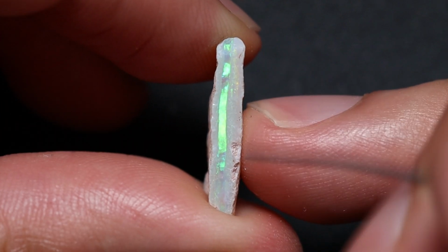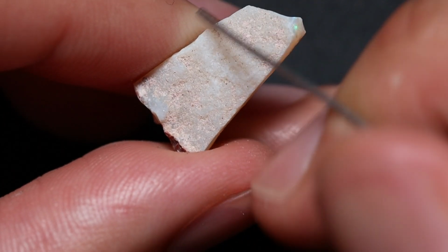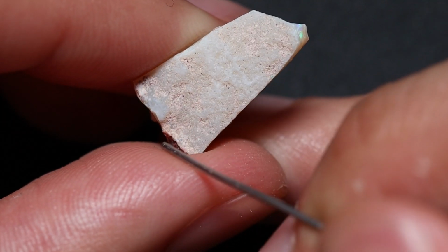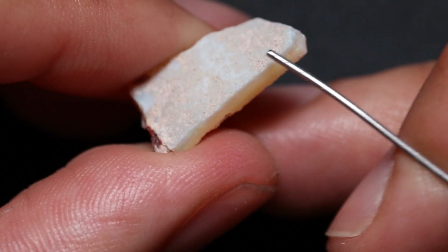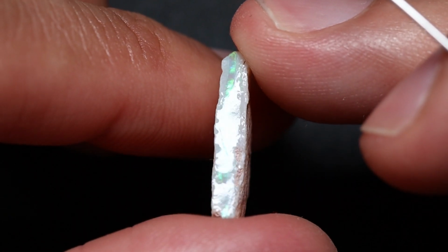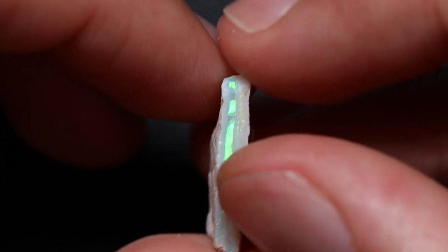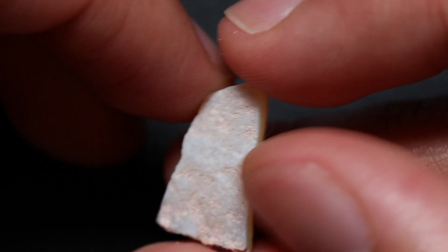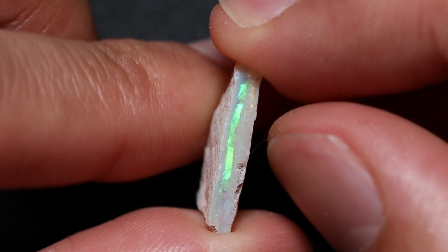So we're going to keep this nice strong backing here and just peel off the outer edge just over here till we hit the color bar. Then we'll have a better idea of shape and then we'll just face it up across here. Going pretty aggressively at first, we'll go for a pretty coarse grit sintered diamond, but then we'll drop right back to the 600 and then finish it off. Probably with the sandpaper drums or the resin burrs. Who knows? We'll see how straight it is. Anyway, let's hope for a good one and spin up.